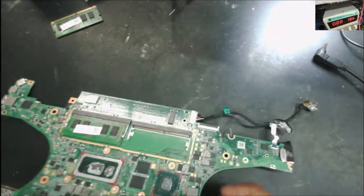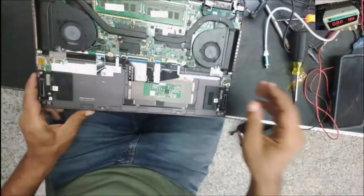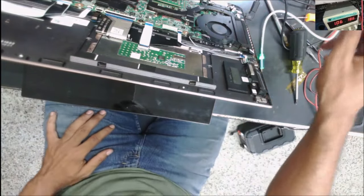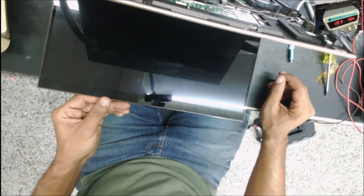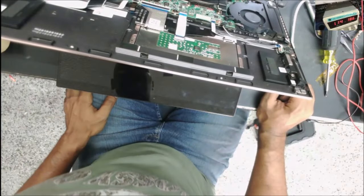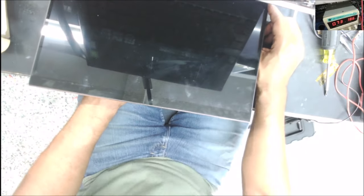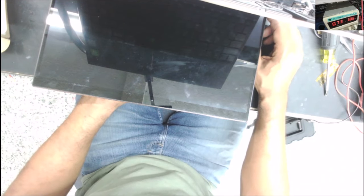Alright, let's put the computer in the housing, and hopefully we can get it to power on. All right, let's test it. So it's taking about 1 amp. Same display, but still booting. It could be because the BIOS is being reset. And still no display. Hmm. 700 milliamp. Still going.